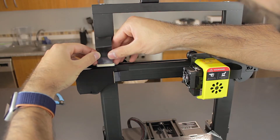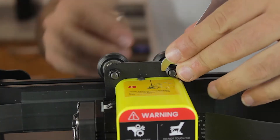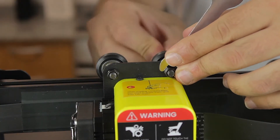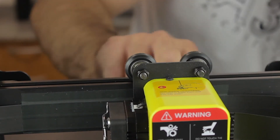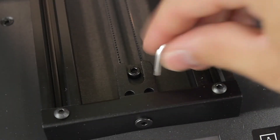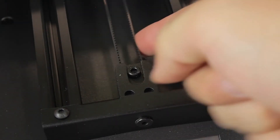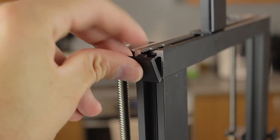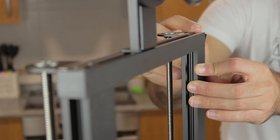Next we'll connect the one that connects the bridge and we are almost ready to go. I'm going to check if the bolts are tight enough — the ones on the extruder block seem a bit soft, but the ones on the bed are looking good and the Y-axis belt is almost good. Finally, I'm going to put the aluminum profile end caps on. That's the last step of this really short assembly.